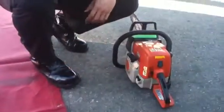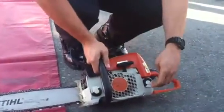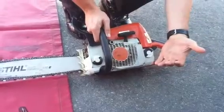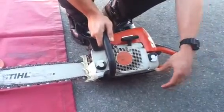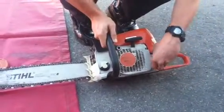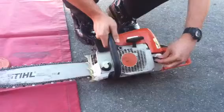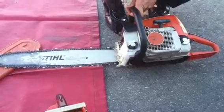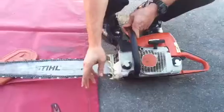This takes a 50-to-1 parts gasoline to one part oil mix. The STIHL 310 holds 18.9 ounces of fuel — you know this is where your fuel goes because you have your gas tank cap with a drop symbol, which means premix 50 to 1. The chain bar oil reservoir holds 11.2 ounces of STIHL bar oil. In the event you don't have any STIHL bar oil, you simply use 30-weight oil; however, after doing this, the saw is cleared out of service.